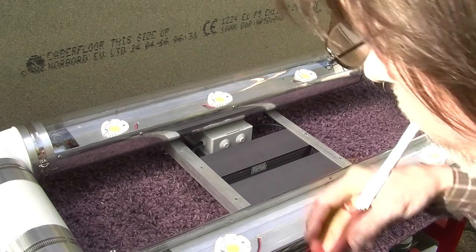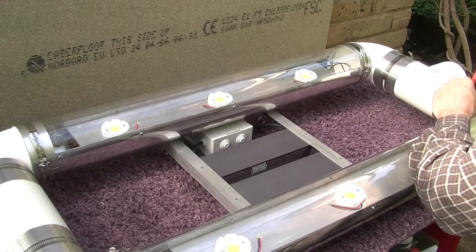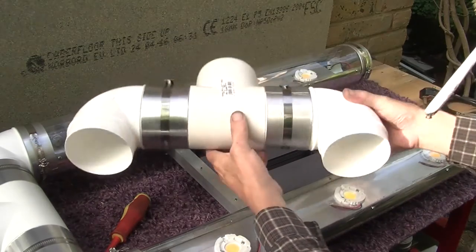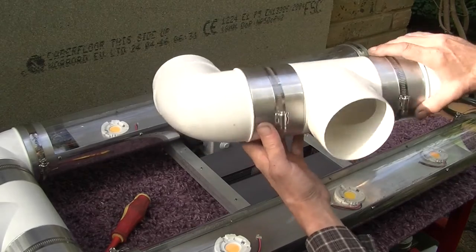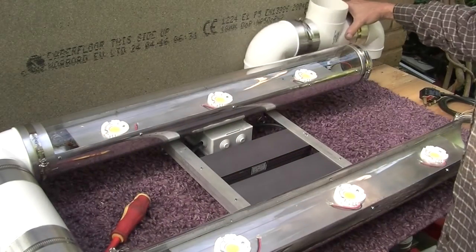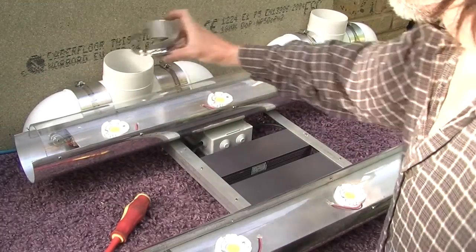Right, let's get this beast apart for cleaning. As a little design detail here, we just use standard 100mm, 90-degree pieces in two parts, simply banded in with a band of aluminium wrapped around on itself under a hose clip. That means this is fully adjustable in relationship to the other parts, and those also have a degree of sideways adjustment on the actual units themselves. I just used a half band and clamped from the back of the existing pipe.